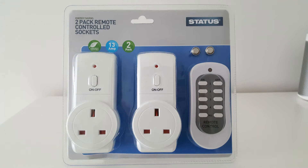In the past I've usually used one of two styles of smart plug or radio plug for the home control system. I've either used the Lightwave range, which has two channels — the premium range and the basic range — or I've occasionally used other Wi-Fi plugs with varying degrees of success. The other day I happened to be in B&M, a chain of discount stores in the United Kingdom, and I came across a packet of these, called Status radio plugs. On the back it stated they use 433 MHz, which is one of the radio frequencies detectable via the RFX TRX 433 transceiver and therefore should be controllable via Domoticz.